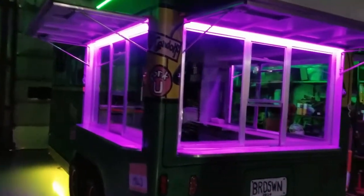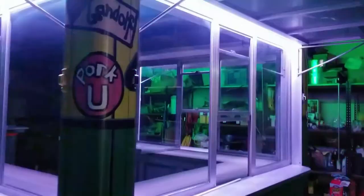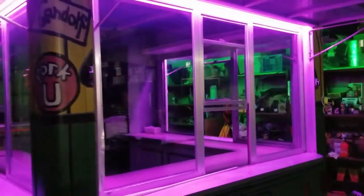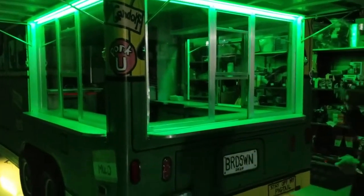Now we'll move to the windows. The windows have six feet apiece in each of them with a six-foot strip, and they're actually mounted in an aluminum channel with an opaque diffuser over top of them. As you can see, you don't really get that bright glowing blinding light — you get a nice finished straight line kind of look for our commercial customers, because these lights can be quite blinding if you're looking straight at them. So we like to put them in this aluminum channel with that diffuser to give it that nice finished look and polish everything off.